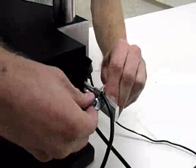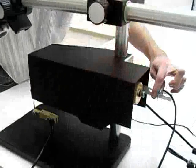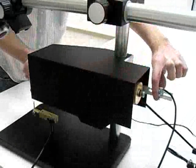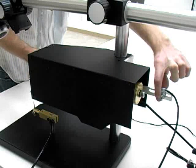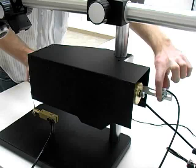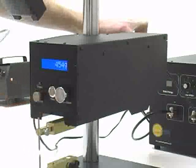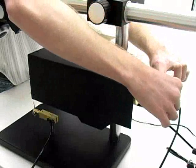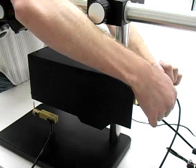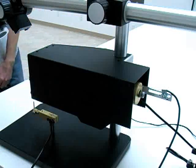To adjust the upstop, the cable mount adjuster must first be loosened with the wing nuts. Hold the wing nut sliding assembly with the left hand. As the right hand turns the upstop, the left hand maintains tension on the foot pedal line. When the upstop reaches the desired position, ensure that the wing nut slider is providing adequate tension to the line without actually tensioning it enough to lower the electrodes. Use both hands to lock the wing nuts in place. The same procedure is used to loosen the upstop control.